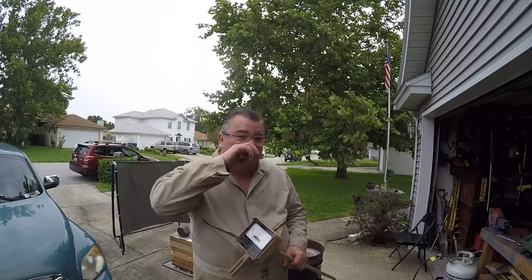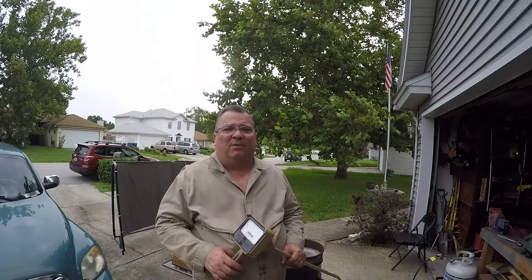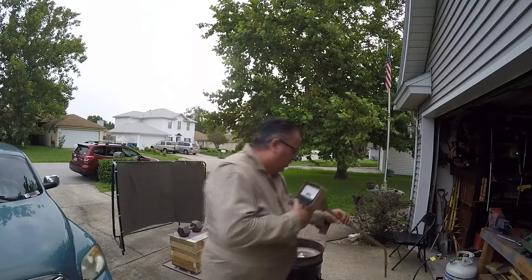Remember, aluminum, its pouring range, depending on what you're pouring, is 1250 degrees Fahrenheit to 1400 degrees Fahrenheit. 1250 being the thicker, blockier things, 1400 being the thin, highly decorative, highly precise things, where you have to have the metal hot enough to pour into all the nooks and crannies that you're trying to form. This thing, I could pour it probably at 1200 degrees and it'd probably still pour, but I want to make sure that all the definition is still maintained in there. Let me put this away.